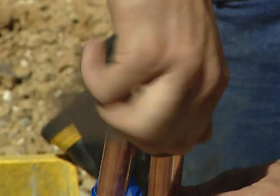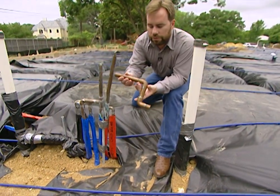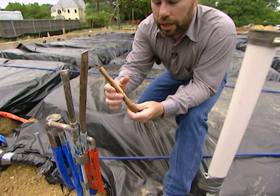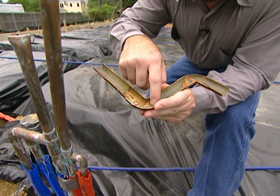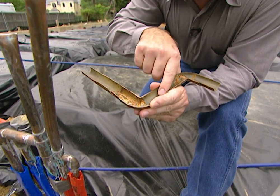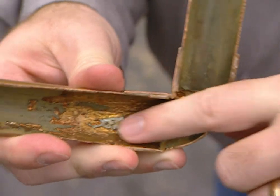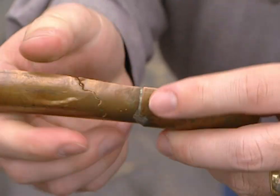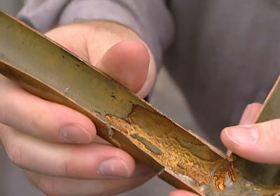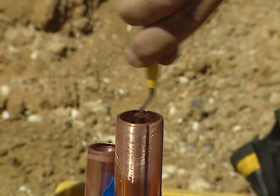You really need to watch how they put those joints together. I have a piece of copper here from a house that actually failed. As you can see, it's got a crack on the side of it. The reason why is when they cut the pipe, they didn't really clean out all of the burrs and ridges in there. What happens is when the water flows and hits that little ridge, it disturbs the water. That water made it turn and over the years kept eating away at the side of that pipe until they finally had a failure. Whenever they cut a piece of pipe, they really need to ream out the interior and make sure that it's really clean and smooth.